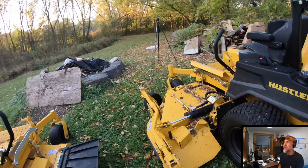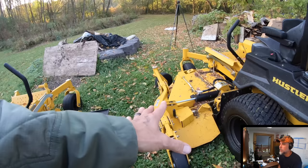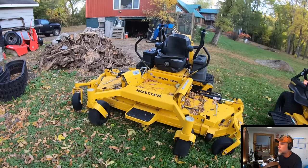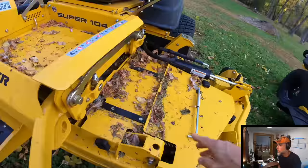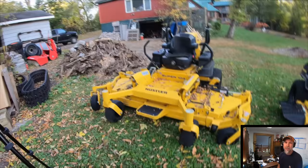They also offer other engine options, but the key thing I like about it is these wings. You see this cylinder right here — this cylinder is the key to contouring. It allows the entire wing to float separately from the main mow board. So you have three components to this deck: your main deck, and then two floating wings. This whole thing contours up and down. They claim 15 degrees but I think you can actually go more than that.